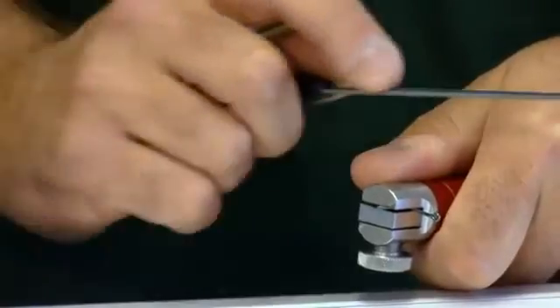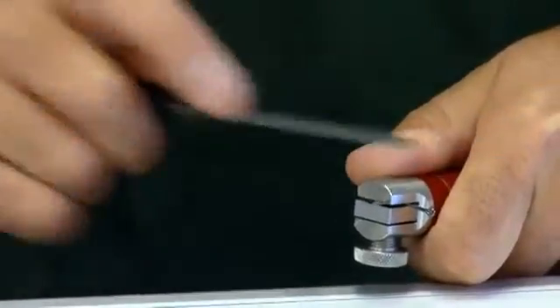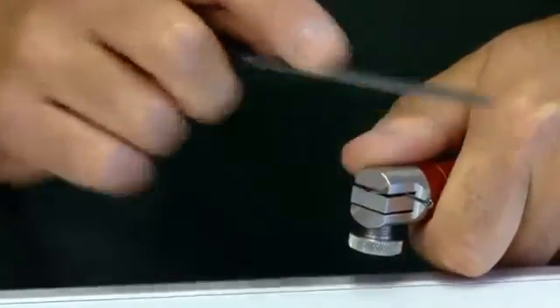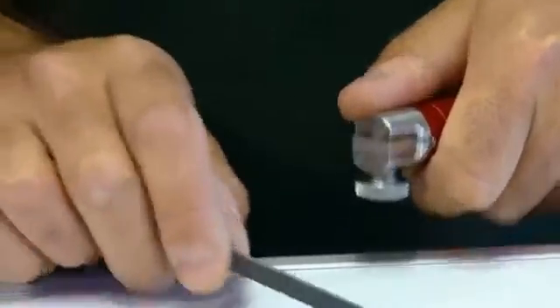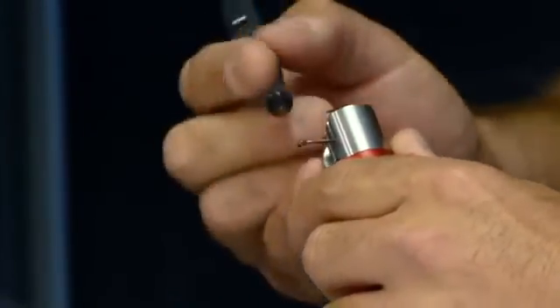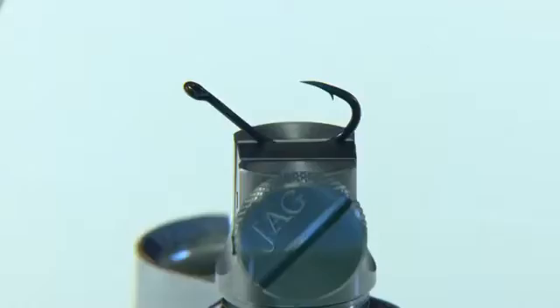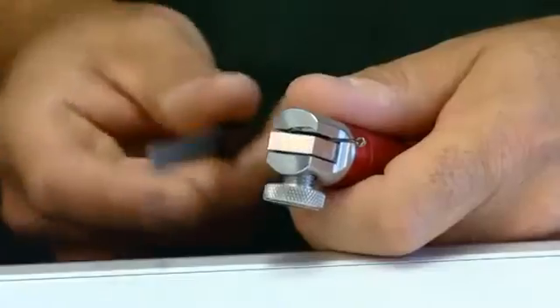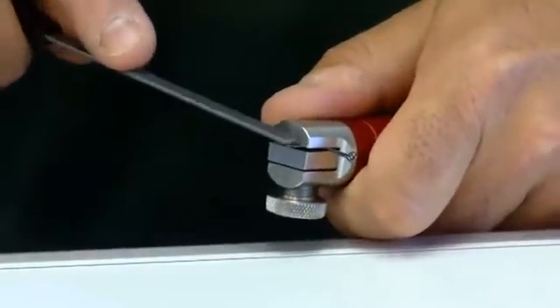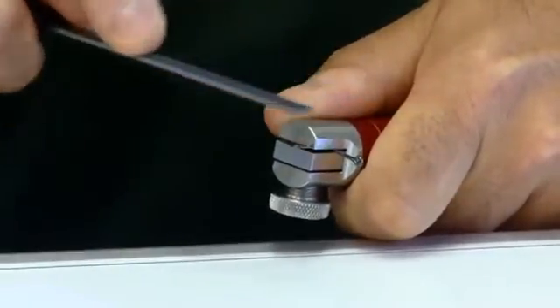This file only cuts in a forward direction. If you're going back and forth, you're sharpening then blunting. So only cut on the forward stroke. We want to be cutting from the barb up to the point - there's no point removing any more metal from below the barb, because once it's past the barb it's in. So just work from the barb upwards. We place this rounded edge of the file onto the vise and from the barb upwards, just use this motion.